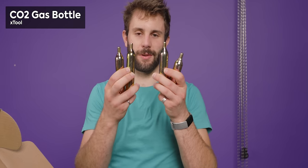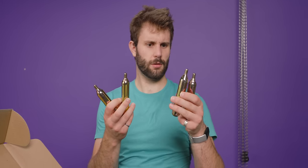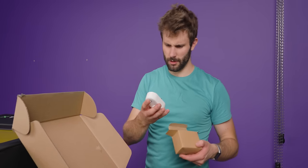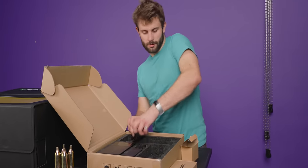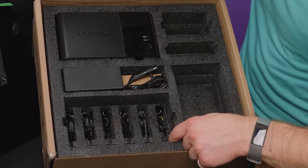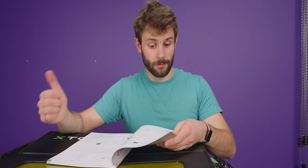There are the aforementioned compressed air cylinders. These ones are CO2 and they look fairly similar to what you use in airsoft or things like that, although a little bit bigger, which makes me wonder how many times each one works. I believe this is a relay box, and in here there are a whole bunch of lights and also what I'm assuming is a fire detection system. This appears to be an emitter and this appears to be a receiver. If there's a fire in the box and it blocks off enough of the space between them, it'll trigger. It has a shutoff for the main power for the laser, and a bunch of CO2 that'll blast into the chamber to put out any fires.